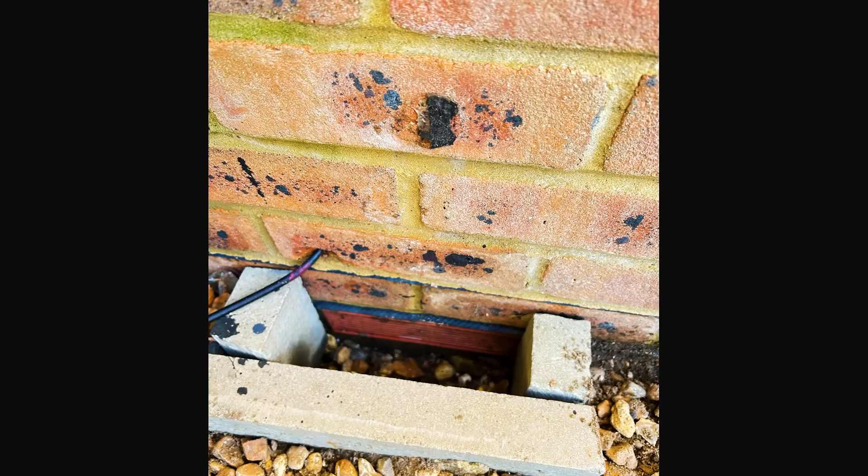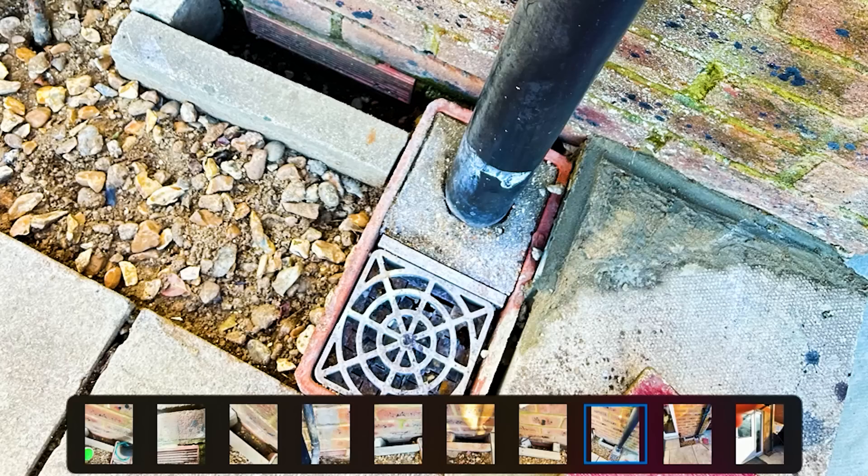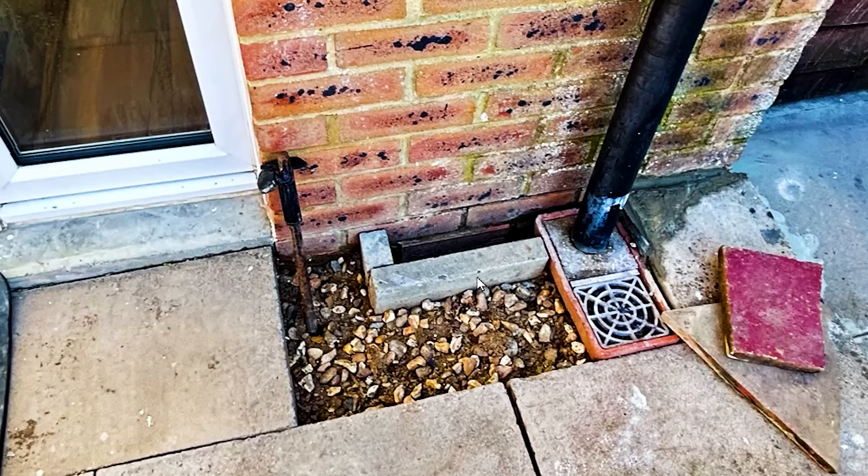You're beginning to get the pattern of events here. Somebody's done a little bit of repair around this gully - it may well be that the gully was overflowing, got blocked by debris, and overflowed around there, making the situation even worse. But whatever is happening, she's got air bricks which are too low in the ground.